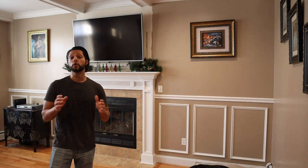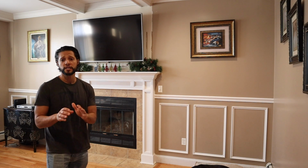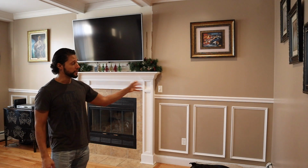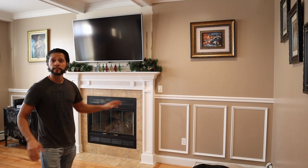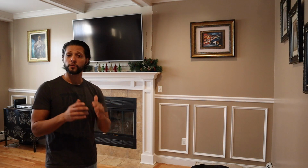Okay guys, so that was a really quick and easy DIY project. Anybody can do it. Just make sure you remember those key points that I stated in the beginning of the video, which is the height of your ceiling, the 1/3 of the wall the way up is where you want to put your chair rail. Make sure that you're consistently putting spacing between the tops, bottoms, and sides of the box with those spacer blocks the way I showed you.